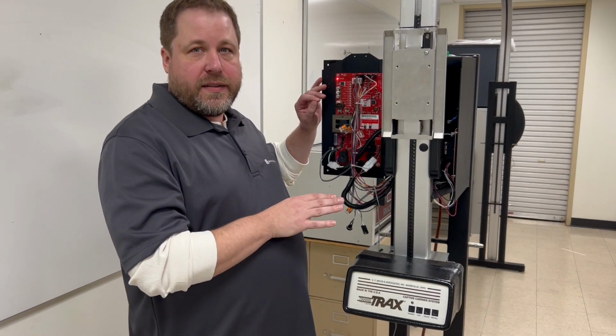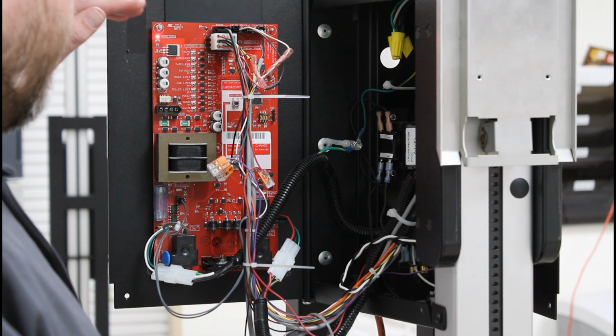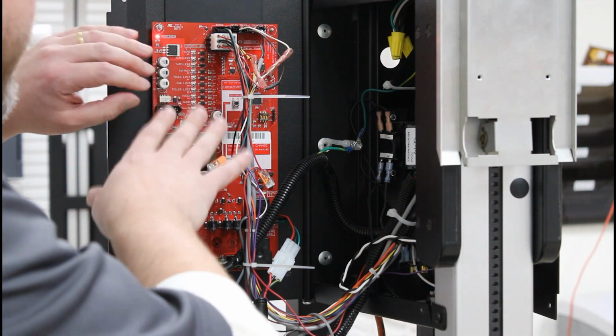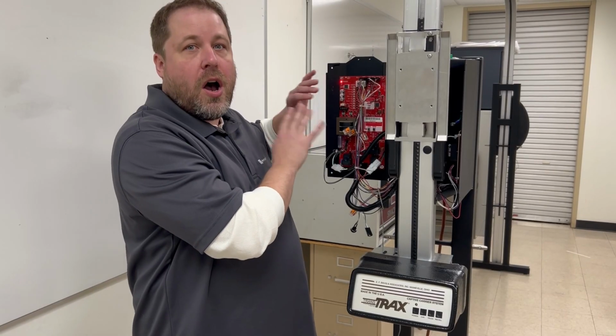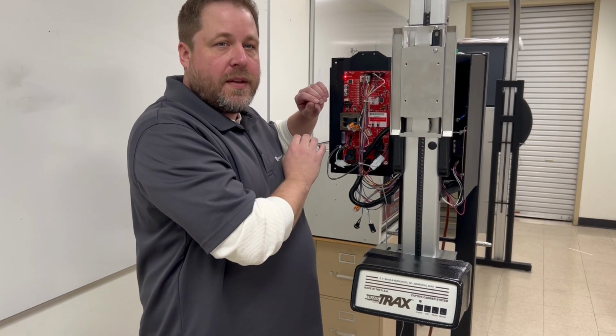When we start the diagnostic process, we want to make sure all of these lights, the 2 teller, 2 truck limit, car limit, everything that's tied to function here, we want to make sure all these lights except for power are off. That's going to help us understand where the problem actually is. So we're going to start there.